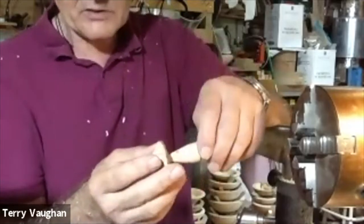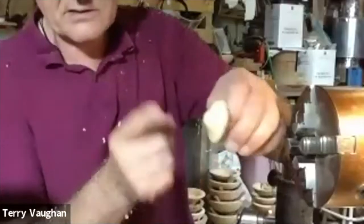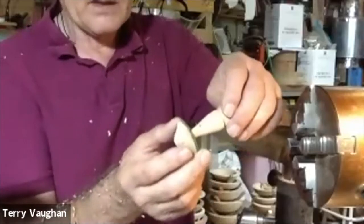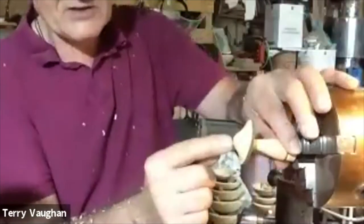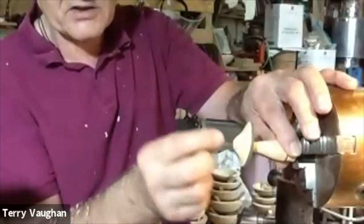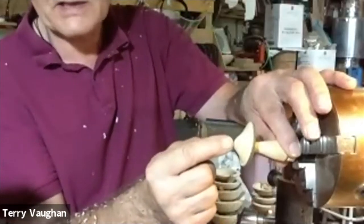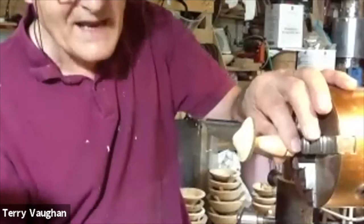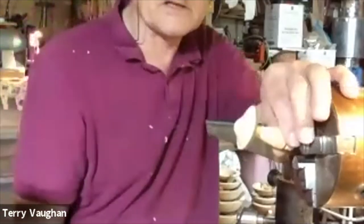By the way, you don't want wood that's got a pith, because that tends to look a bit funny. Is it end grain or cross grain? It's end grain — it's from a branch. But some wood has got a hole down the centre filled with soft stuff, and you don't want that, especially if you put your tailstock into it. So your tailstock not in the centre, not on the pith? Yeah, but then you still see the pith — you have to decide for yourself whether that's a problem.